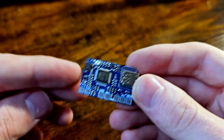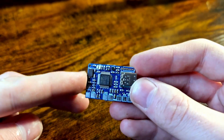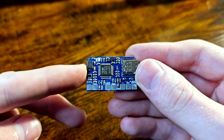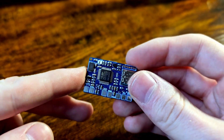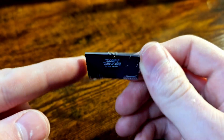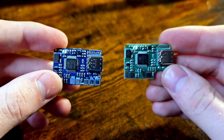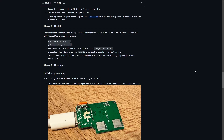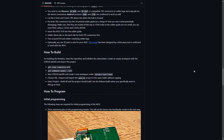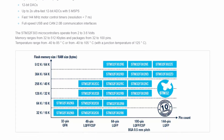While ferrite clips still definitely come in handy, this board allows you to create a cable that goes to the radio, keeping the board completely separate, and if you'd like, kept in a nice little box that can be 3D printed. This device comes with the same benefits as the AIOC — it shares the same firmware, it's open source code, and this chip is kind of overkill for the project, allowing a lot of leg room for future additions to the code.